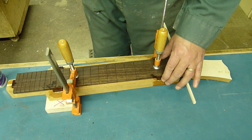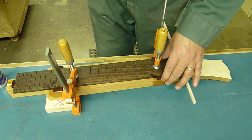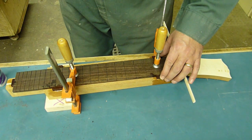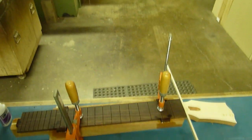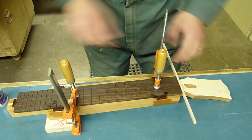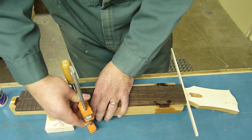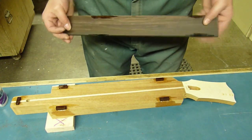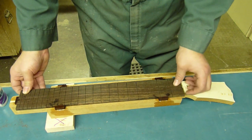The hide glue should be a little bit hotter — we're looking for 145 degrees Fahrenheit — but we'll gradually get it up to speed. We've got all the little blocks glued in place and I'll show you how easy this is going to be to glue in. We're going to take no time at all indexing it when we go to pop this in.